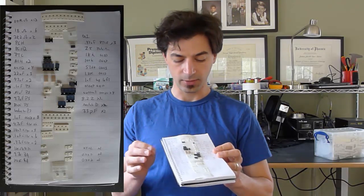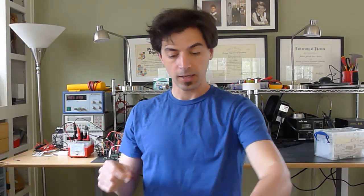Then, when I want to build them, I use tweezers and pull off the cellophane, and use a vacuum placement machine to remove the parts from the tape and place them on the board. Of course, placing them on the board doesn't help unless you have solder paste on them — otherwise you'd need a soldering iron, tweezers, solder, and all that stuff.